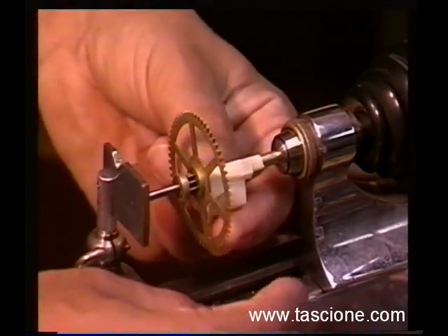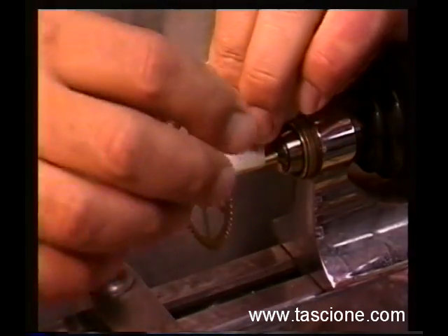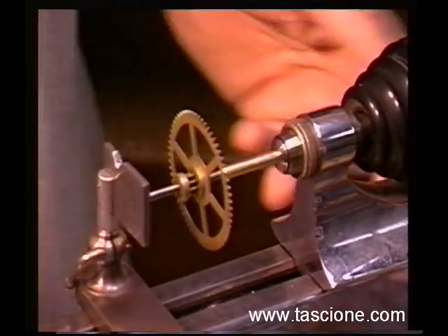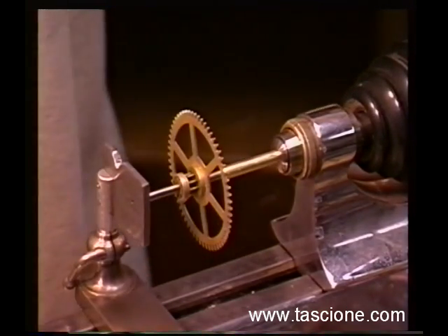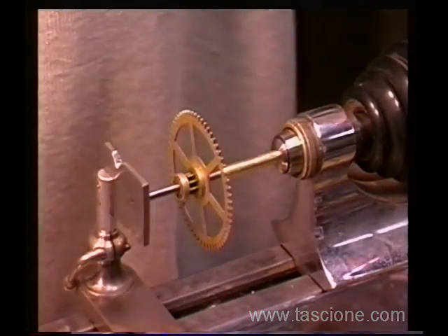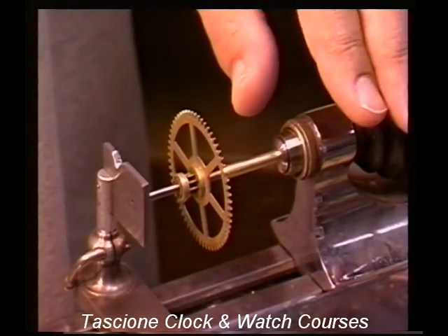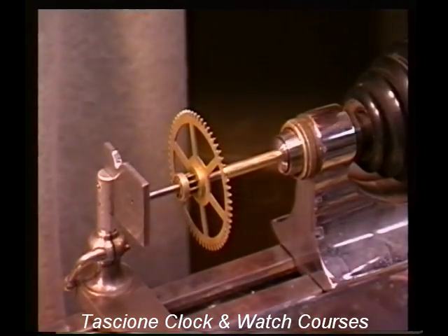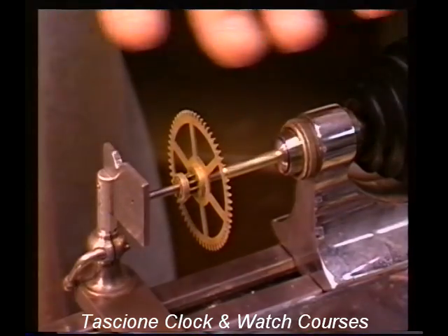But we have another way to do this, and it's very easy to set up the tooling. You don't have to go out and spend all kinds of money and time looking around. Let me get this piece of masking tape off here. We're going to make up a couple of what they call dogs. I have them out of wood, brass, and steel. But I just want to show you how little you really need to do the type of work needed. Especially with larger gears like this — when you get into watches, we'll be doing that later on in another video, watches and small carriage clock gears. You're going to want to have a little more precision when it comes to all of the tooling.